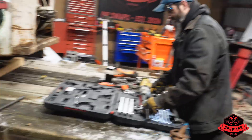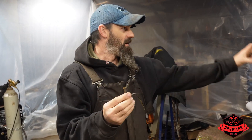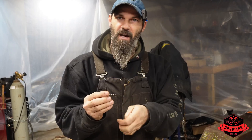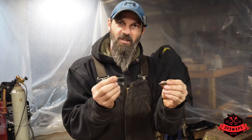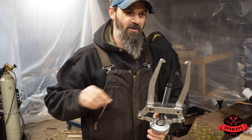I don't know if I'm doing that properly. The instructions call for two quarter-inch bolts, but they only want half-inch long threads to thread in and bottom the head out along that spline. So what we're going to do is just cut them off and file them clean. Hopefully we can get these threaded in - that'll give a nice solid surface.